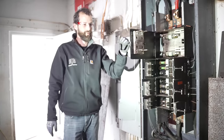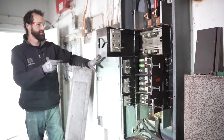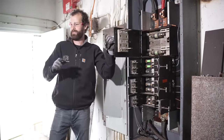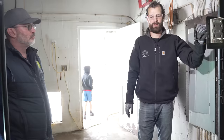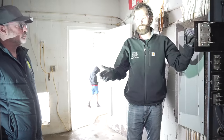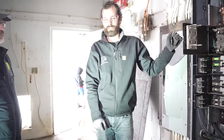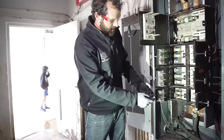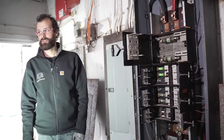We don't have to have that disconnect because we have the exterior disconnect out there. Now, we've got that trough there and the conduit going down, I haven't figured that out, but we could at least potentially eliminate that disconnect and this cabinet, and then just replace this one and keep that one. We could do this one 6 months down the road or whenever timing and budget align. I know sometimes funds have to be recouped after a big project, so maybe it's 24 months. But what I'm seeing right now is this thing will last and serve for another 24 months. That's not a question in my mind yet, but I'm gonna check all the little connections and supports and see if anything's cracked, broken, missing. But first impression, really good.